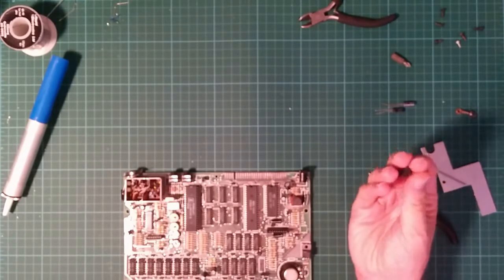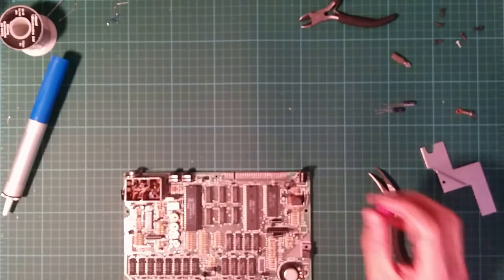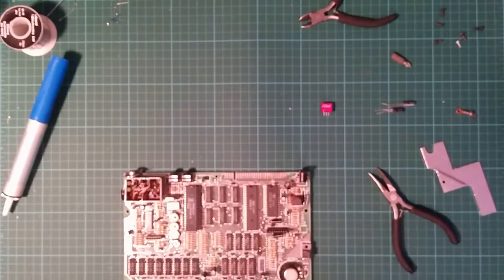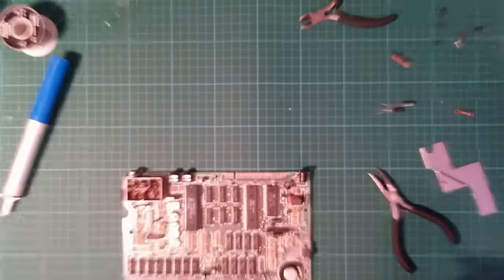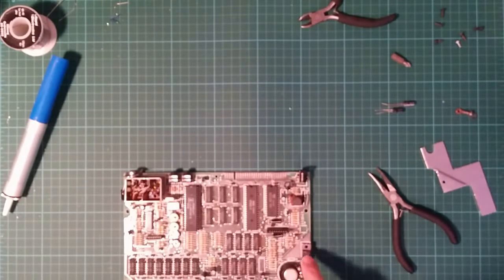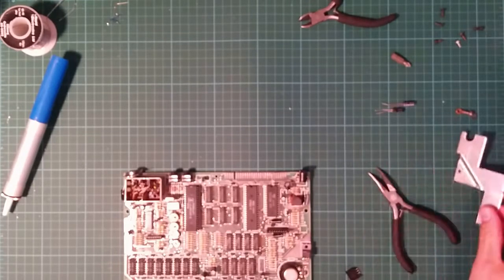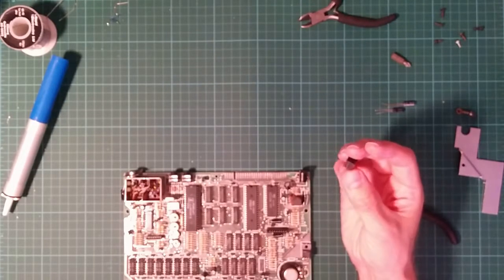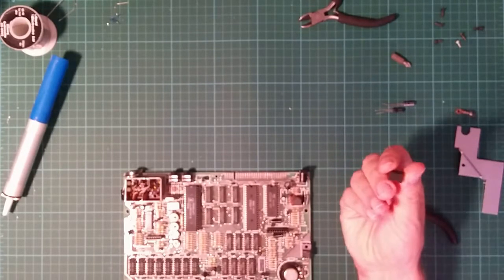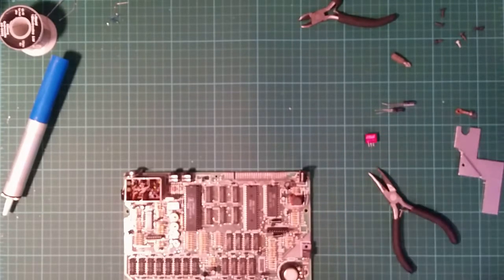So it's now 2 days later, it's Wednesday, and I filmed the first bit on Sunday. The regulator has arrived. Beautiful little piece of kit, where this is a brute force resistive linear regulator that drops 4 volts by putting it through a massive resistor, generating massive heat, needing a massive heatsink. This is a modern switch mode device that cheats. It's so efficient that they haven't even put anywhere to put a heatsink.